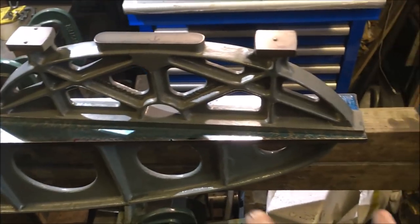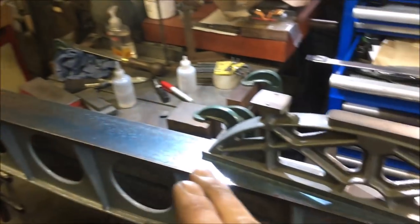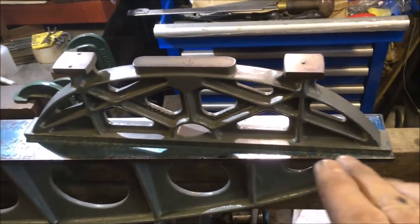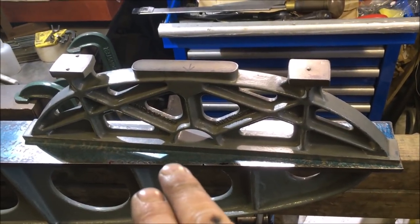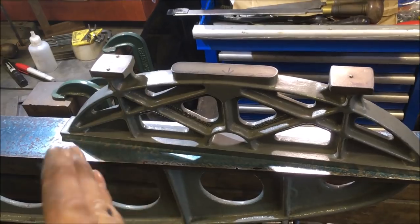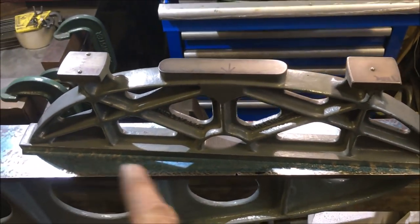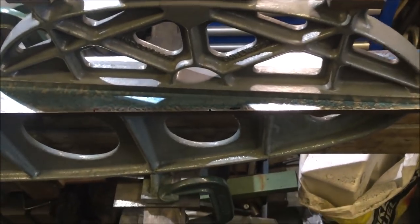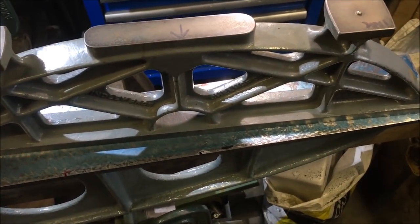Well, we're just bringing in the end again, and I've got it on the transition between the 52 inch to there and then the second print. The hinging point is not quite where it should be, and yet it's fine up to here. So I'm just using the shorter 24 inch straight edge to try and pinpoint exactly where that hinge point is, because I can't do it spinning the longer one.